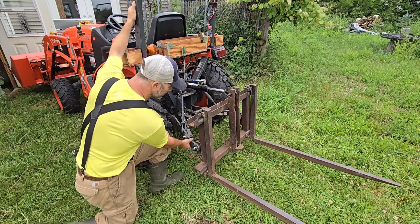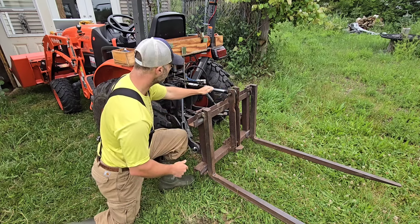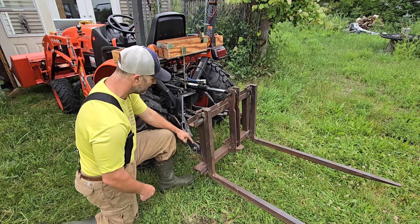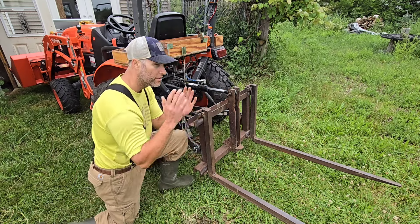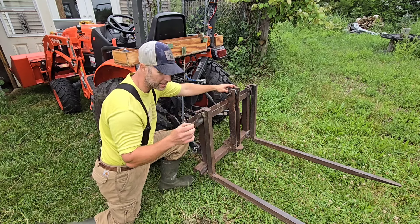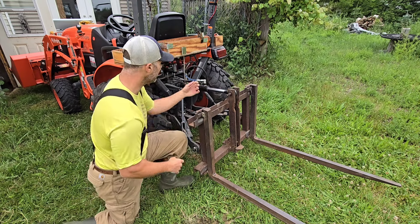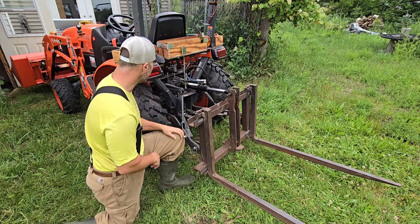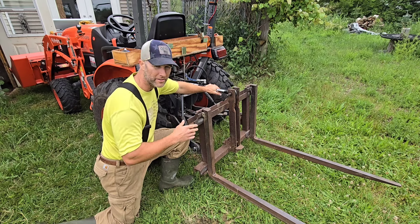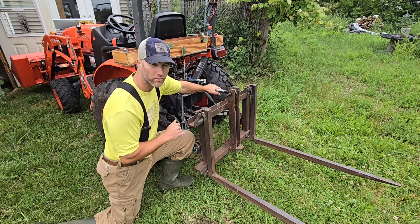Hooking up to something is so nice — I've showed it on other videos — but you can literally move what you need on the back and line it up for these pins. Sometimes these pins can be a pain if you don't line them up just right backing up to something. If all you need is just to move it a half inch or an inch, I've even just moved it all the way to where I need it with this. You've got to be careful you're not pinching anything, but just for hooking up to different implements it's worth it alone, not to mention how many different times I adjust it throughout the day.